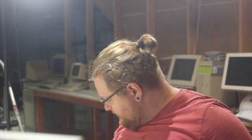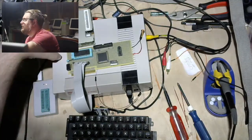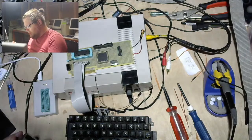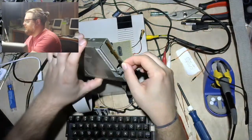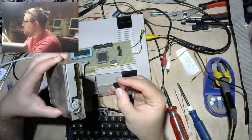I also, let's see, I wrote this down in the description and I've already forgotten everything that I want to do. Oh, floppy drive needs power. NES does not have 12 volts on it, interestingly, and I don't think I'd want to load the NES's power supply with that kind of load anyway. So I have grabbed my slowly dying ATX supply that I use for powering random things. It does not have a floppy connector on it, so that's going to be a thing I have to do real quick, is find a 12 volt and a 5 volt that are fine. I mean, this isn't ideal. I would like to recognize that this is not how I would do this in a finished thing. But yeah, regular headers go on there just fine. So probably just solder up the right connections.